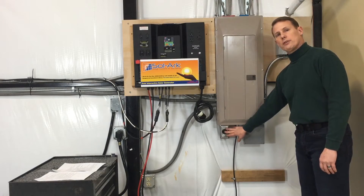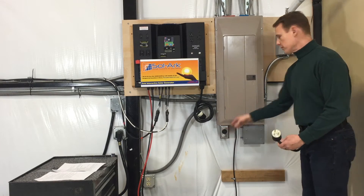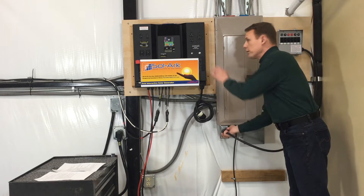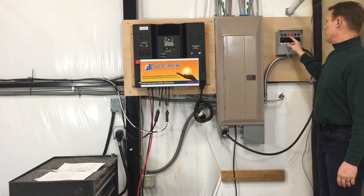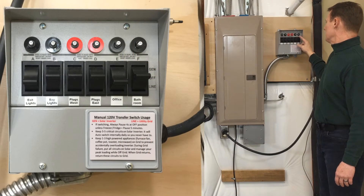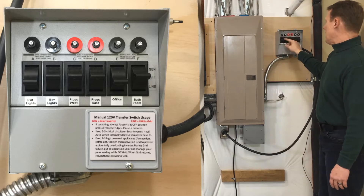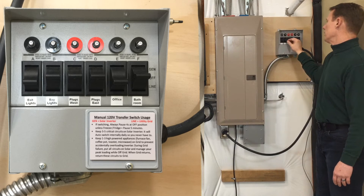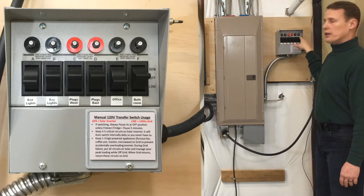To verify that I've wired this 120-volt receptacle correctly and that I've wired up the transfer switch, I'm going to power up this receptacle with the 30-amp breaker and plug in the transfer switch — which would normally plug into the solar generator — so now it's getting power from the grid. These are all in the off position, but I can power up each of these circuits and they should be working. I'll flip each one over to the generator input, pausing in the middle for about four seconds, and they should all power up without triggering any breakers.